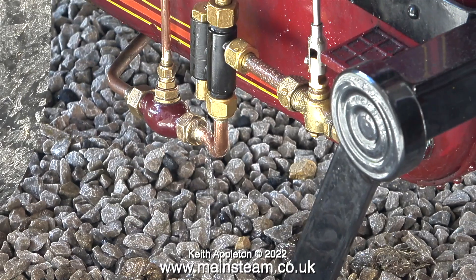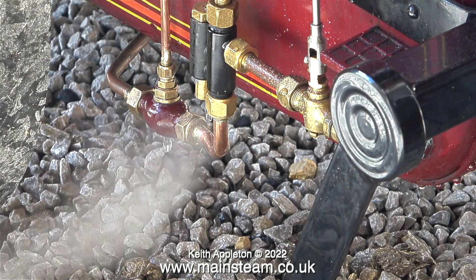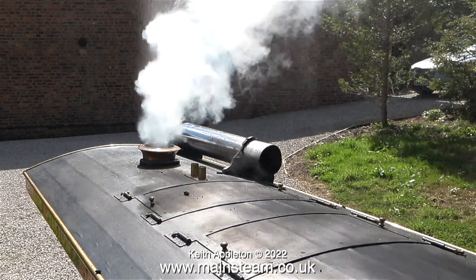Here's an excerpt from the end of part 66, which was a live steam test. In this clip, when the boiler was almost full, the injector suddenly started working. I'm going to leave you with this image of the injector actually injecting. The reason it knocked off here was the boiler was full — so full in fact that water was being carried into the cylinder and here it is rushing up the chimney.